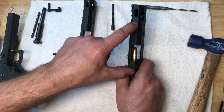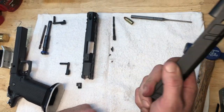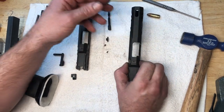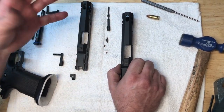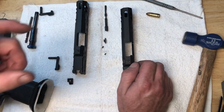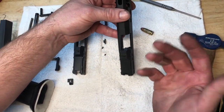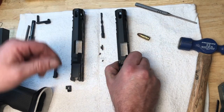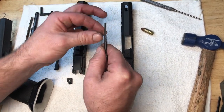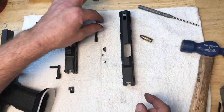On the new ones, I want to put it on the breech face just like I have it and I'm going to shake super hard. If after six or seven hard shakes it comes off, that's okay. If it comes off before that, we probably need to add a little tension. When we're doing it with the old style, we're probably good if it stays on for four or five shakes. That's not super accurate — different shakes — but it gives you an idea. If you slide this case up and it falls right out, then we know we have almost zero extractor tension. That's a problem. Remember that with both of these it's a moving target — as you shoot this gun, if you shoot a high pressure round or debris builds up in this tunnel, it's going to affect how these move. So they do require adjustment over time. It's a serviceable part.